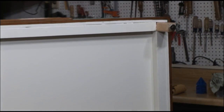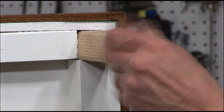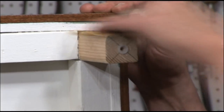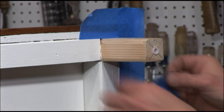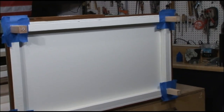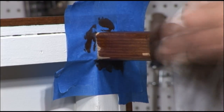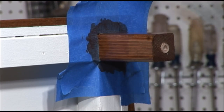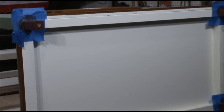We turned the cat house on its side to make the legs easier to finish. Remove the adjustable floor glide and give each leg a good sand with 220 grit sandpaper. After all four legs are sanded and dust-free, protect the underside of the cat house with blue tape on all four sides of each leg. Apply a nice even coat of stain with a clean rag on all four legs. After the stain has dried, give three coats of polyurethane total.